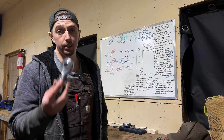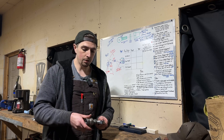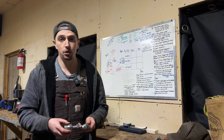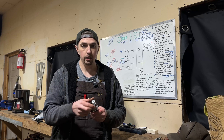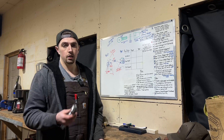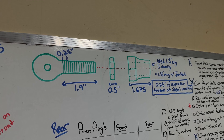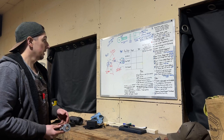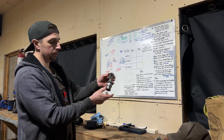The other topic I want to discuss is thread engagement on my heim joints. It's really important to make sure you get proper thread engagement when assembling these, and it's also going to maximize adjustability in either direction. My approach is aiming for thread engagement of one and a half times the diameter of the shank. With this rod end shank being 7/8 inch, I need about an inch and a quarter of thread engagement with my weldable bung to have maximum strength through this rod end. That equates to having about a quarter inch of exposed thread while also accounting for the jam nut.